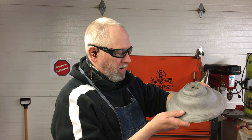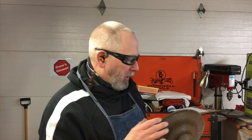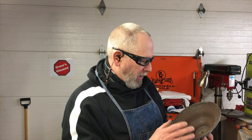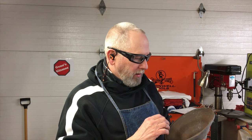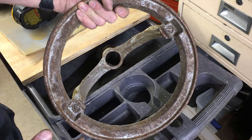Just spent quite a bit of time at the sandblaster. The outside came out pretty good, but the inside not so much. The biggest problem is I can't see what I'm doing inside — the lighting's just wrong. Even with LED lighting, it's just not bright enough to overcome the shadows inside while sandblasting. So I'm probably just going to use a little bit of rust reformer on the inside and be done with it. I'll spray paint the outside with a primer just to keep it from rusting back up again, and we'll move on to the next piece.